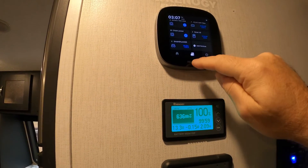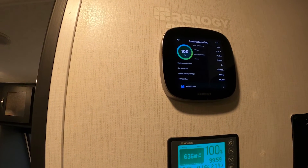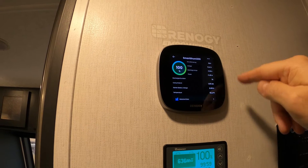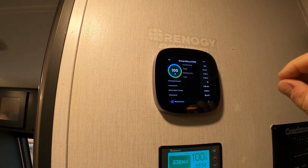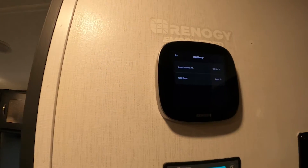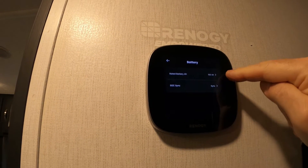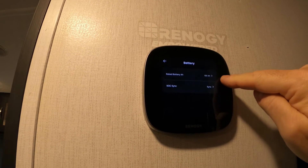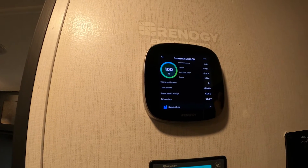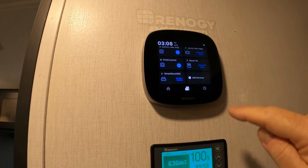In order to install the shunt, we had to do a little rearranging in the battery bay, and it was a bit tricky getting it connected at first. When I brought it online initially, it wouldn't let me change a few settings, or when I did change them they wouldn't stick. I've got a 600 amp battery bank but it keeps reverting to 100. I'm going to put in a work order with tech support about that. The low state of charge alarm I did get to stay, and overall the settings are working well.